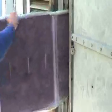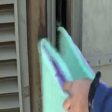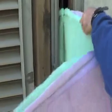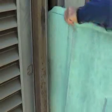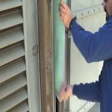You just grab the first one there, pull it out like so, fold it up, set it down, grab the new one, get it started. Again, from the top, the strong parts of the grid, which is the tops here, he's using one to push in, and he's using the corners. He wouldn't push it from the middle because that's the weak part of the grid and it'll just bend. So you do it like so. You push it until you feel it touch the other end of the plenum,